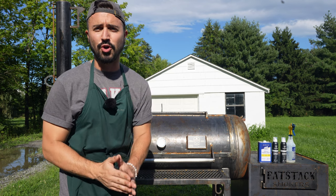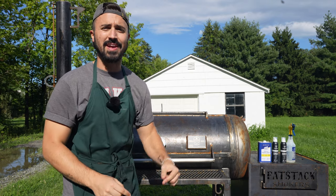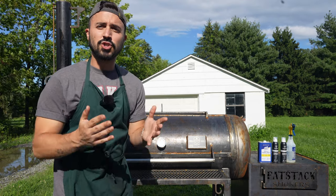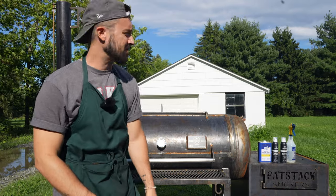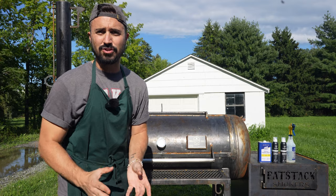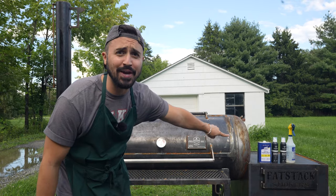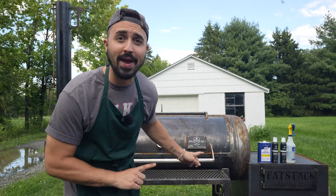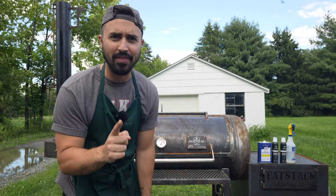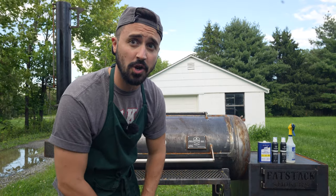I also got to give a shoutout to one of my subscribers, Hojo Barbecue, my guy Ted. He hit me up and said his pit was rusted from top to bottom when he bought it, and these are the steps he did to clean it up and make it shine — and Ted, that pit is beautiful. So my guy Ted told me: hit those rust spots with some distilled white vinegar, then clean up the metal with some odorless mineral spirits. I want to season the inside and outside of this pit with nothing but sprayable Wagyu beef tallow. Months ago I bought the Wagyu beef tallow spray knowing I was going to do this video. So enough horsing around — let's spray down these rust spots with some vinegar to start.